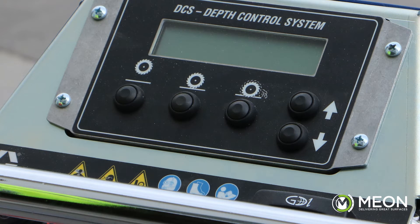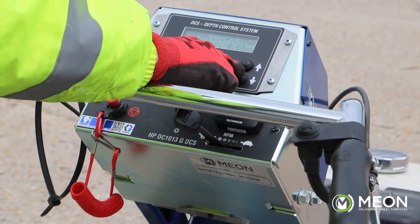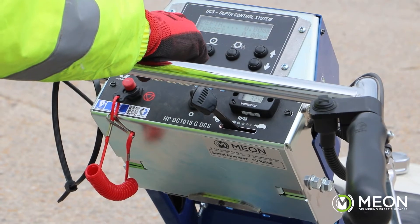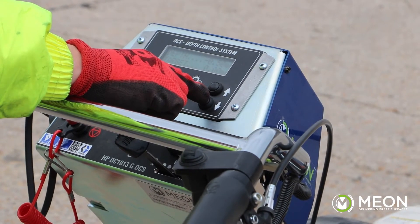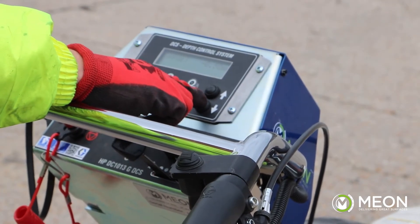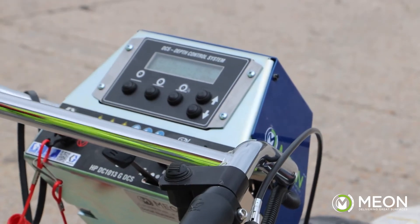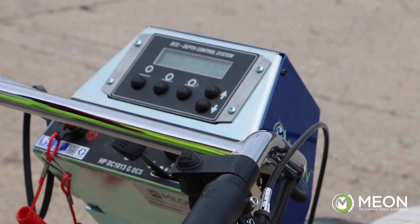We can adjust the preset positions of the surface level and cut depth. To adjust the zero position, we first need to make sure the brake is on and the engine is running so the drum is spinning. Then we use the down button to lower the drum until we can hear the cutters just touching the surface. Then we simply press and hold the zero button for two seconds until the display shows as 100% programmed. The zero position is now set to the surface level. For the cut depth we follow the same process, lowering the drum further to the cut depth desired and then pressing and holding the button to save the position. Alternatively, we can press and hold the cut depth button whilst the drum is in the zero position and then adjust the depth — this method does not lower the drum as you adjust the height, so it will not damage the surface immediately below whilst you're setting up. A quick press of these buttons moves the cutter height to the preset depth for us to start removing the markings.